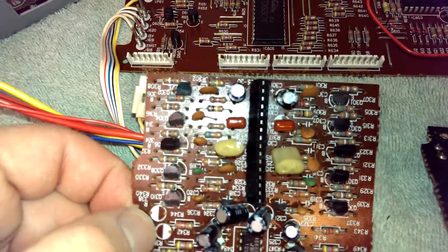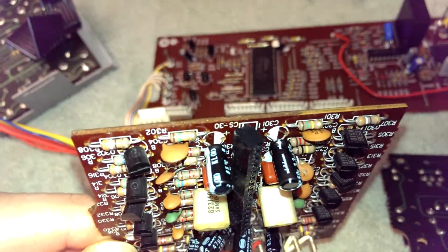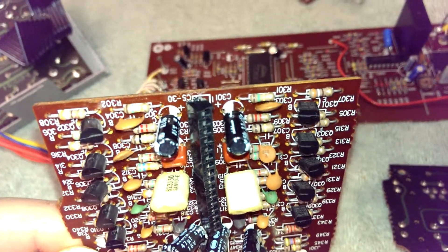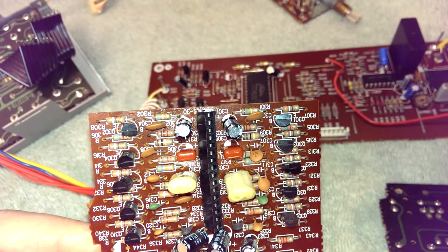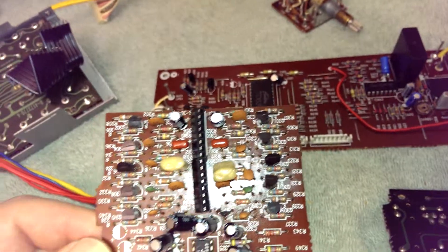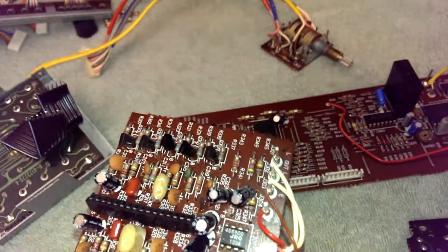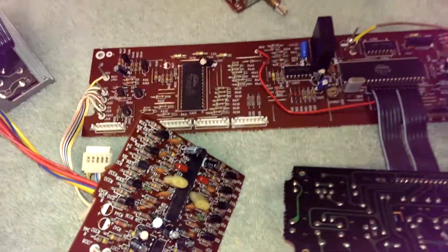So it's five bands — five little one-transistor amps with frequency-dependent elements in them. Each one has a slightly different selection of passive components to get the right band. The only thing I've done on this is inspect it for cold solder joints and replace four capacitors, and they weren't bad — I just did it out of preventative maintenance. They're coupling caps, and if they go bad, you get system-wide audio dropouts that are hard to track down. They infuriate the customer and they can take me a while to find, so I just get rid of them — 80 cents for some insurance, essentially.